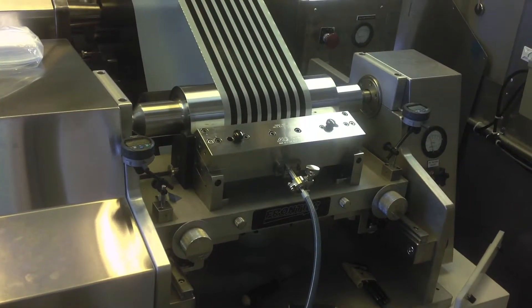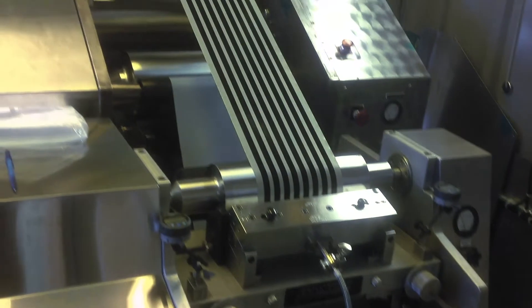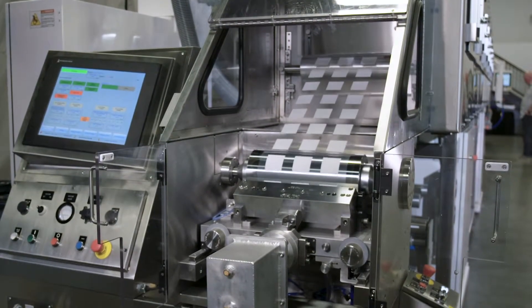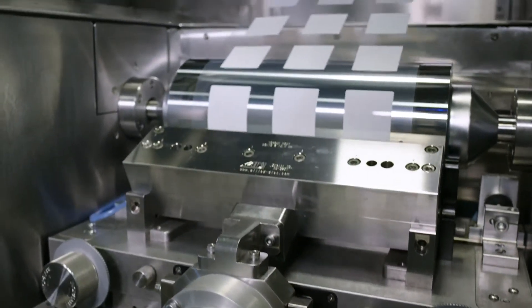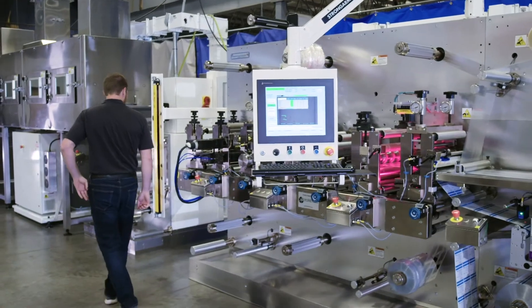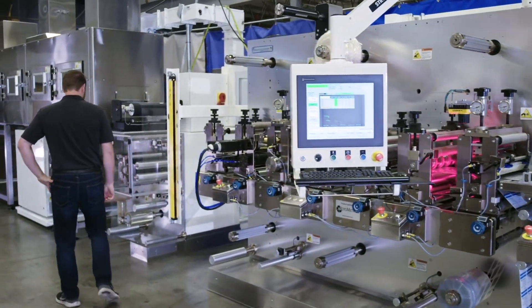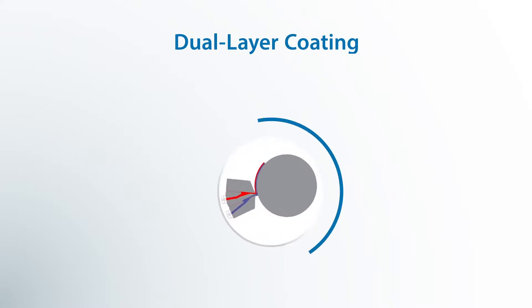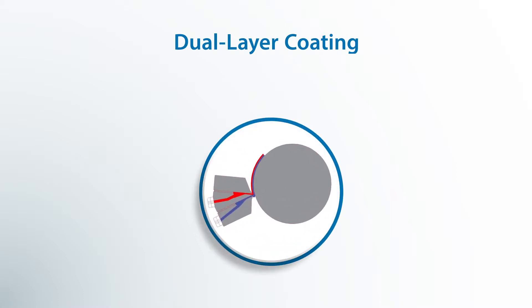Some of the other things that people are interested in is the ability to coat stripes or zones of the substrate. Another technique is patch coating. Not only can we make the stripes, but we can also make discrete breaks in the coating before and after and still control the coating thickness from beginning to end within a couple of percent. One of the other special techniques, pretty much only on the slot die side, is we can do multiple layer coatings as well.